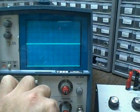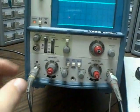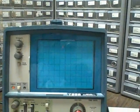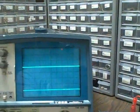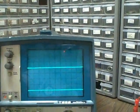We're zeroing right now. Channel 1 and channel 2 both have four divisions they can rise, and in both cases we're on 20 volts per division with essentially a 20-volt signal. At 20 volts per division, pressing A comes up one division, and B comes up one division. That would be right.